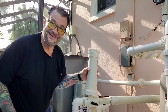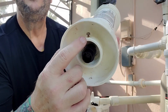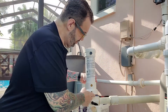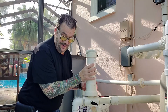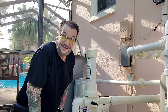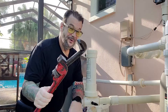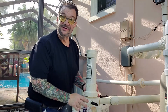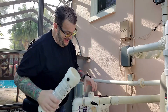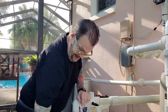Before I forget, there is one other issue: several people on YouTube have pointed out that there's a screw inside here — you can see it right there. Once you screw the fitting down, you can then drive that screw into the PVC pipe. I wasn't aware of that screw and I've been doing this stuff for a long time. I thought it was really stuck, so I got out my Stilson pipe wrench and jimmied it off — it was a bear and I'm surprised I didn't ruin everything. I basically unscrewed the whole thing with the screw still driven in. I wire-wheeled it off, put some Teflon tape on it, and put it back together. I'm not putting the screw back in — be aware of it when taking yours off.